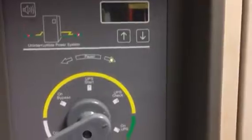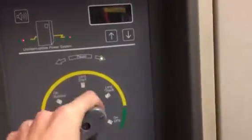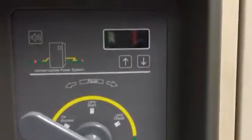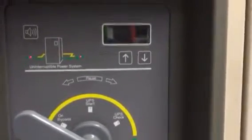Now we're going to go from position three to four, which will sync the UPS to the input power. Starting testing input synchronization, it says. Unit is still on. Normal operation — load on UPS 33%. Mark is standing here smiling. Happy.